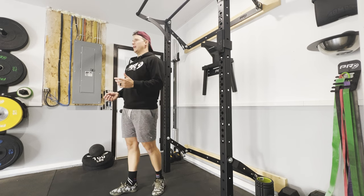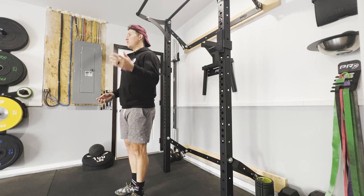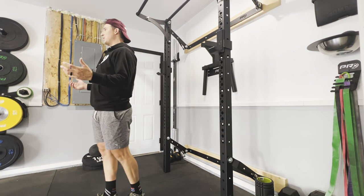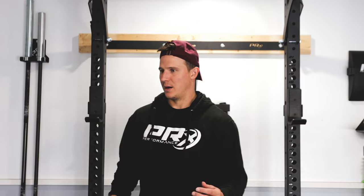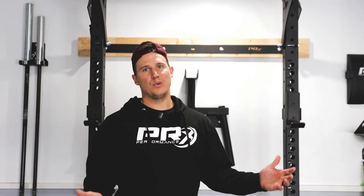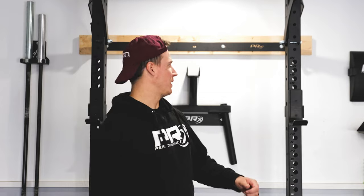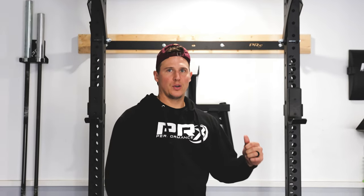There are a lot of different ways you can incorporate stringer boards. We've seen gyms where it's more about the aesthetic, and they're using different planks, or gyms where you use a two-by-four and paint it the same color as your wall because you want to hide it. In my case, I kind of like the contrast on the white and gray, so the wood really looks good there. A two-by-six is recommended — two-by-fours work — but you want a really sturdy mounting point, because the stringer board goes to the studs and then your rack mounts to the stringer board.